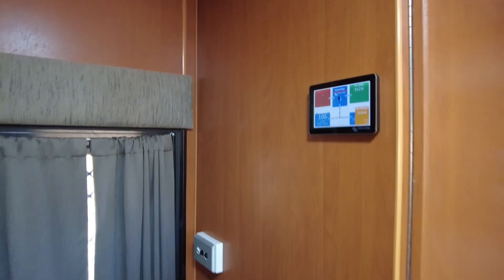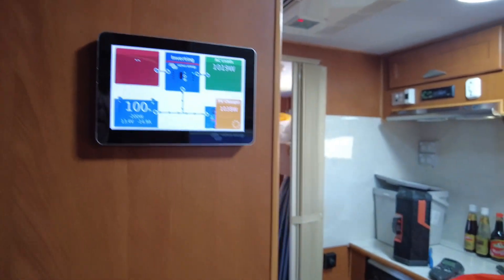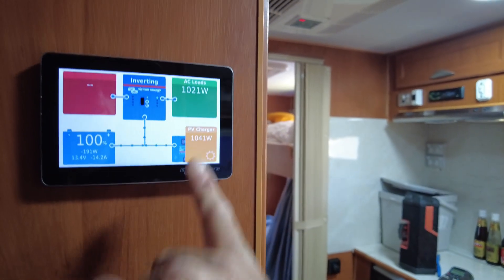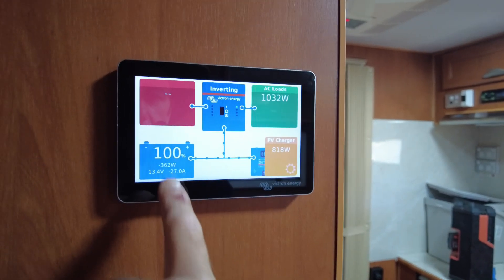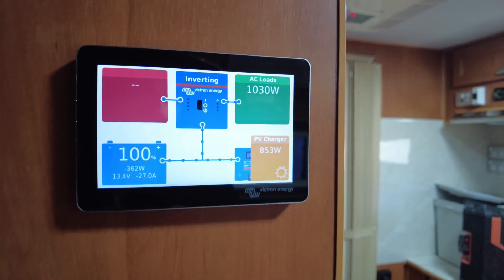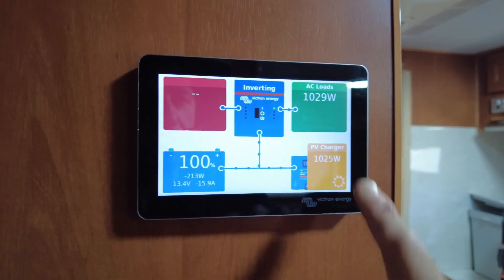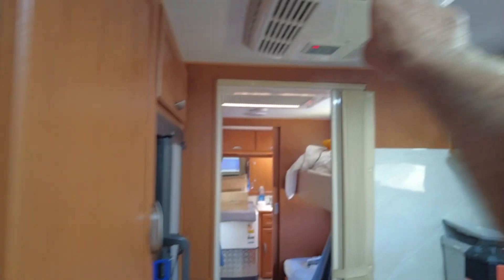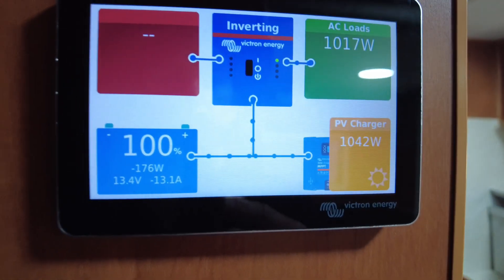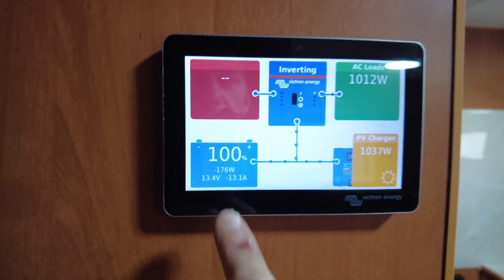I'll take you over to the touchscreen. Old mate is exactly the same eye level as me, so I put the screen at eye level — easy to get to as soon as you open the door. This is your solar production on the roof. You can see the lines moving. We're pulling 15 amps at the moment — might be going through a cloud. The numbers are always chopping and changing because solar is generally variable. This is what we're actually using from the battery — running on flat out 16, using about 170 watts. It's going to last a long time at this current usage.